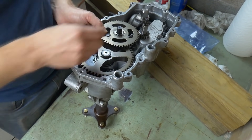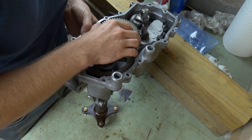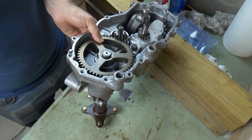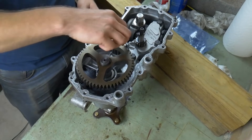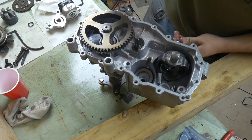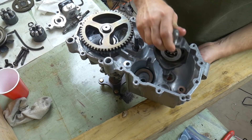Now we're going to remove the gears on the inside — you just have to remove the middle ones. Keep track of the order everything goes in. There are washers on top and bottom, so remember where they go. You don't have to remove the big gear; it's connected to the axle and will just sit there. Next, remove the three bolts that hold the center section in — those are the only three bolts on the inside. After removing the center section, you can remove the pump and the motor along with the bearings, and then remove the last piece.